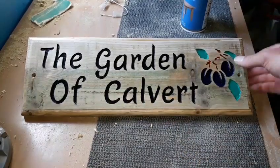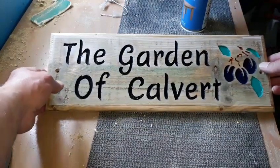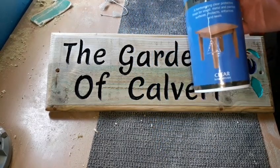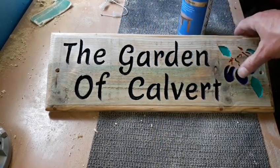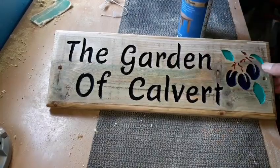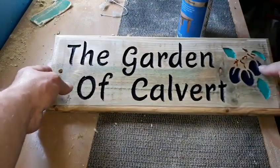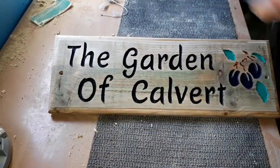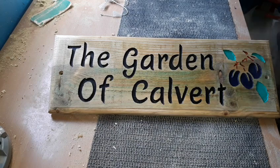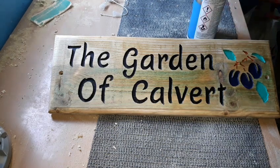You can see from that it's all brushed down nice and clear, no dramatics. Normally I'd put linseed on this but I'm going to use this spray no matter what, so I'm just going to spray over some of this polyurethane just to seal it. Remember this is a fence panel so it's already been treated - pressurised, tanalised with chemicals - so just make sure you've got your mask on when you're carving this, because there could be all sorts of stuff coming out with it. We'll spray it down, just to darken it down slightly, and I'll do this three or four times, give it a bit of a coating and then we'll come back when this project's finished.